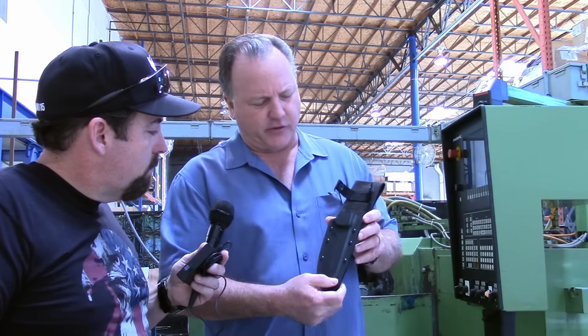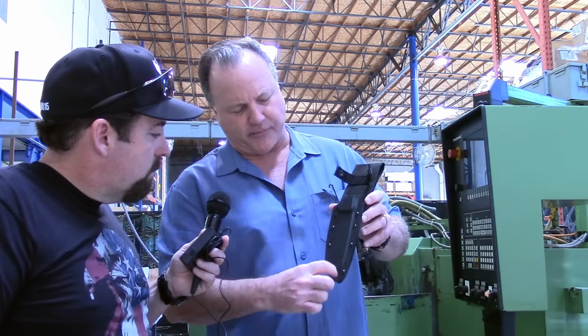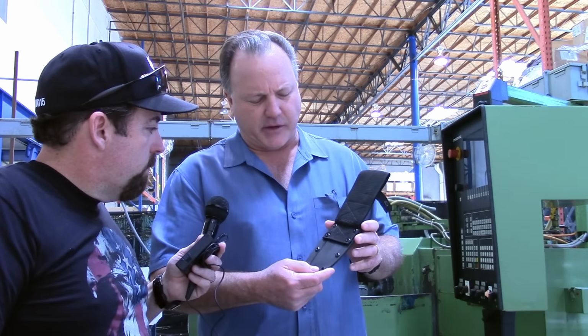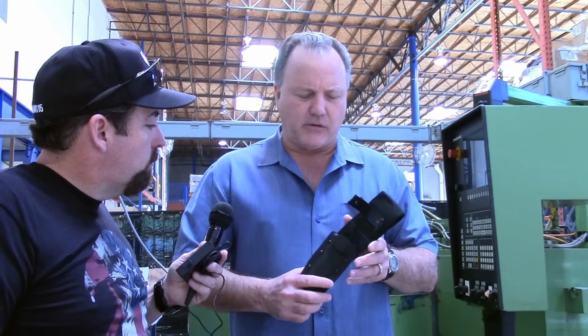And there's a 300 series stainless steel band that literally comes down and wraps all the way around. So the Kydex at that point becomes basically just a dust cover. Okay. So we went a little step further. We CNC'd the female fasteners on a Swiss screw machine out of 300 series, and we made this a take apart. Nice. So they can service it.